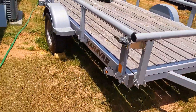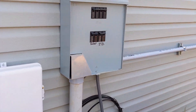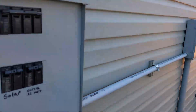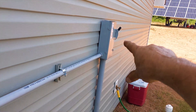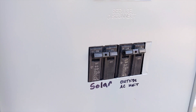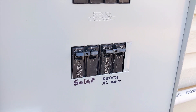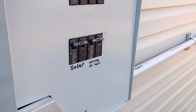It's a switch out at the inverter. If the grid's down for a long period of time, just hit that switch. Then you can run drop cords from this receptacle to your loads. If you got sunlight, you can do a lot - just a nice little feature. While we're pulling the wires, we do that. In here we have the SMA - both inverters are up there and brought to that AC disconnect.